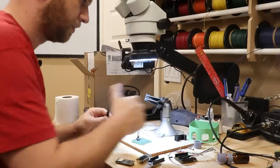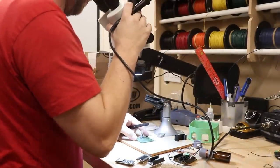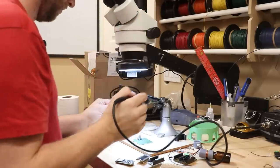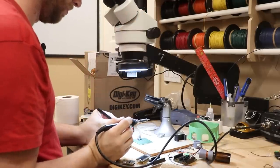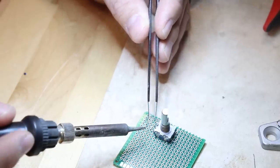My plan is to write a little simple menu on the microcontroller that I can select different settings and start the process of solving the combination. So to do all of that, I'm going to use an encoder that has a push button built into it. One of the things I need to consider when using an encoder like this is switch bouncing.